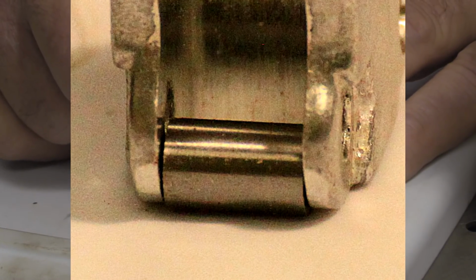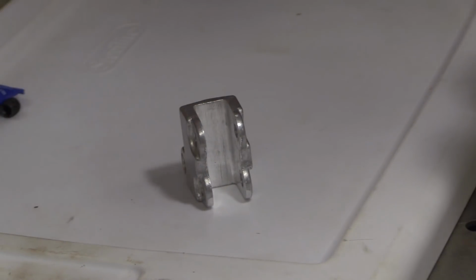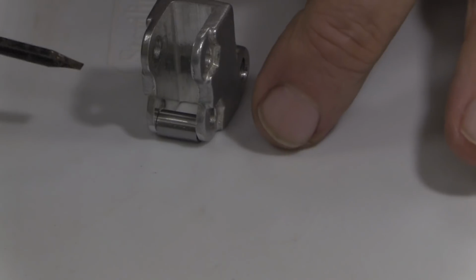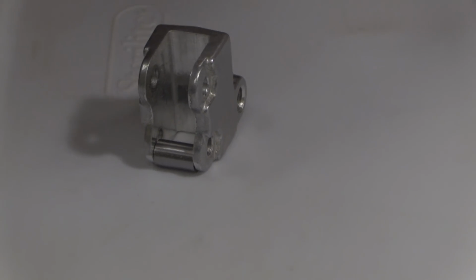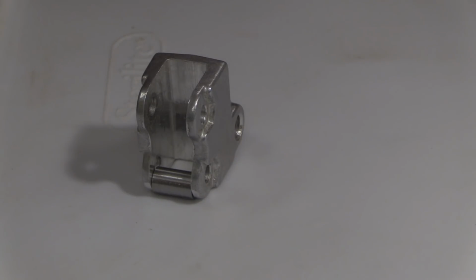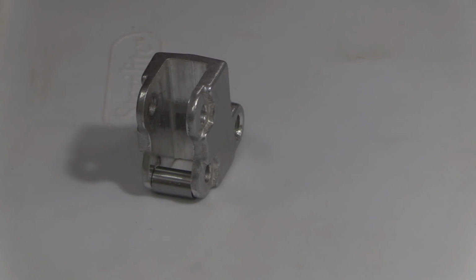The general idea behind this is that you tension this, you tighten up the hardware on this, such that you're bending this blade chuck just slightly, just enough to be able to capture that hardened sleeve on each side so that it doesn't move. So what winds up happening is when you put a bolt through there and a nut on the other side, you start tightening that mechanism up. What you're doing is you're compressing the sides of this casting to make firm contact with that sleeve so that the sleeve doesn't go side to side. More importantly, it doesn't go front to rear. You're actually pressing this softer casting and embedding that sleeve into the casting. So you put a pretty good amount of tension on it. Just don't get terribly carried away, which I know you're capable of doing.